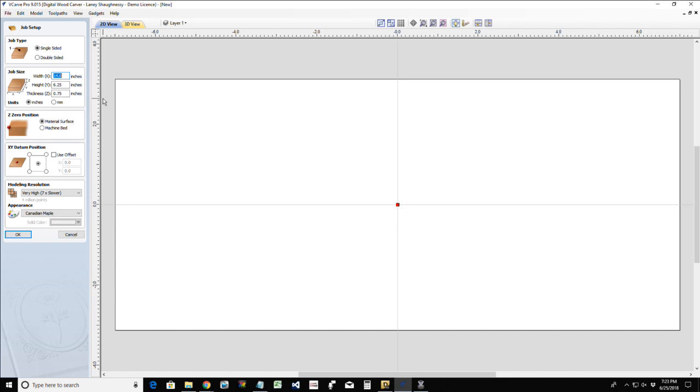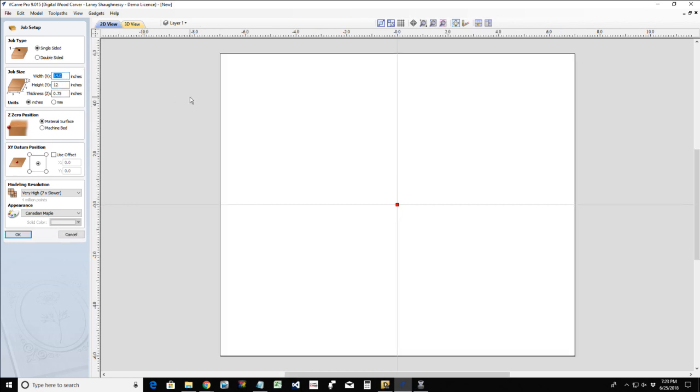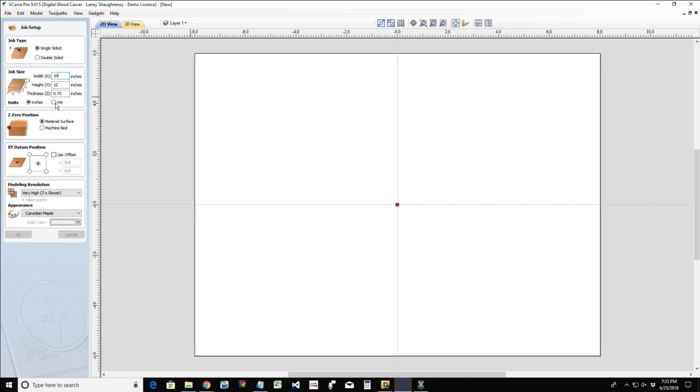So when we're working with the inlays, the face grain we'll be able to do here, but these can also be done for end grain cutting boards, which of course would not be cut on the CNC. Those would all be cut and assembled through a table saw and what have you. Now, for our cutting boards, we're going to just start off with a 12 inch by 16 inch by 3/4 inch cutting board. And I'm going to be touching off on the material surface and working off the center for the starting point.